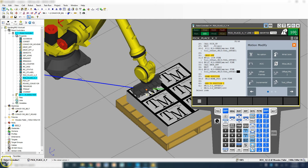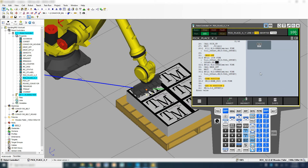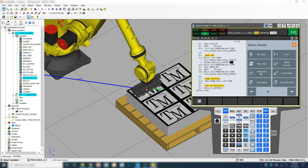When we move over, we're going to go Offset Tool Offset Position Register number five. So now we have our offsets. Now that we have our tool offsets, we have to use our position offset. Let's go right at the end — arrow over at the end on all three of these positions. We're going to go to Offset Position Register and use Position Register number four, which is our XY offset. Then go to the actual placement, Position Register number four. And then at safe position, Position Register number four. So we have a lot of position registers here utilizing our offsets and movement of our objects.